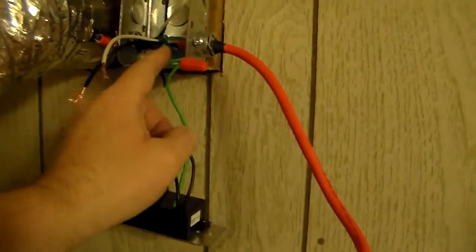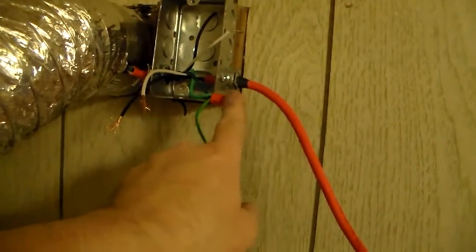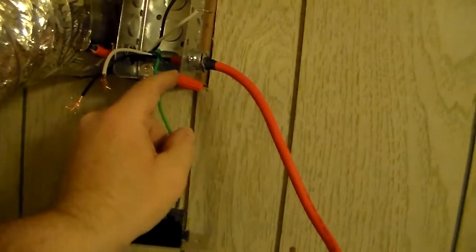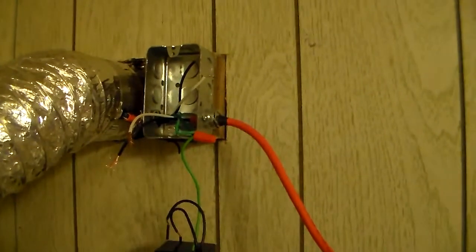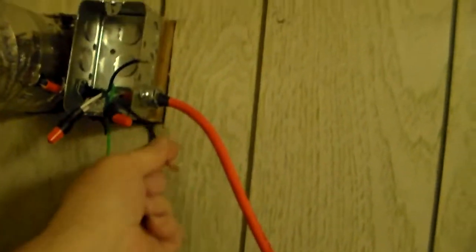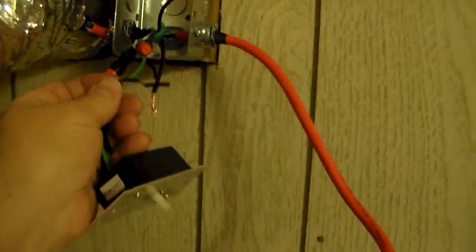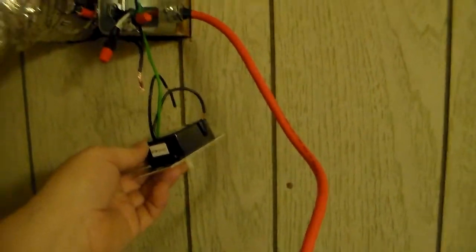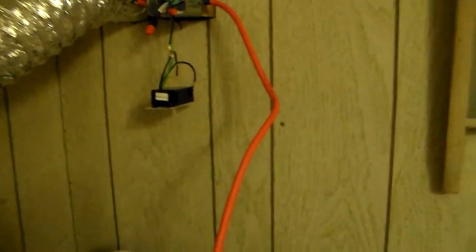The marr connectors in here look like they may be stainless steel or tungsten — not aluminum, not copper — so these may be okay. But if it were an electric baseboard heater drawing a lot of current, you'd want to make sure you're not connecting copper to aluminum or your marrs will burn up in a couple of years. So: connect all three grounds — from the switch, the fan, and the extension cord — under one marr. Then connect one black from the extension cord to one black on the switch, and the other black from the fan to the other black on the switch.